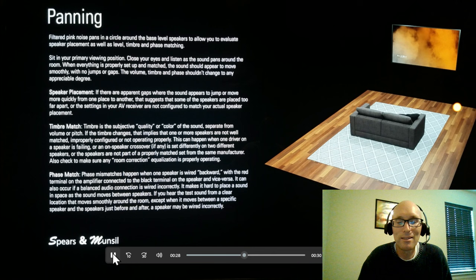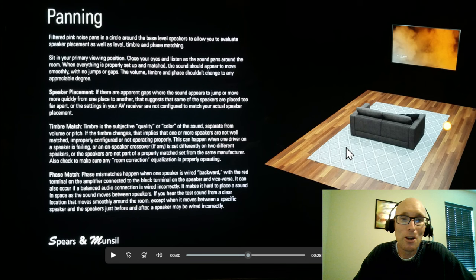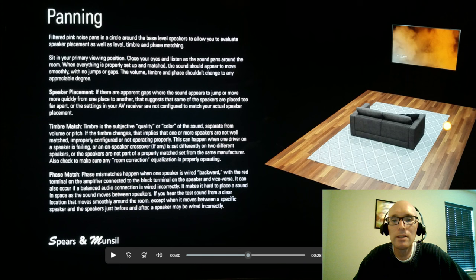So my sound came around the side here and into the right surround speaker. The first thing I noticed was the volume difference. It just went lower, right? And again, I'm in my main listening position, it went lower. So I went on my channel trims, on the input, again, like we've already done with the other test tones. On the actual input itself, I raised the right surround by 1 dB because I thought it's probably about 1 dB, and I just played it again.